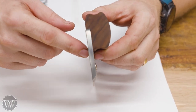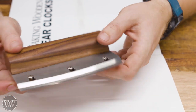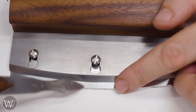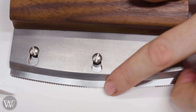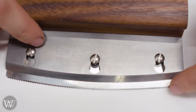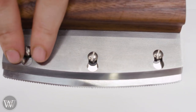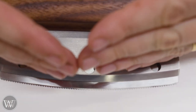One of the interesting things about this is you can release the teeth here and actually pull the blade out, re-sharpen it, and re-saw the blade. They also come with different tooth patterns because throughout the years, in different traditions, there are different tooth patterns you can get. Here we have what is considered a French-style cut — all the teeth are pointing to the middle, cut at 90 degrees, so they're a very aggressive cut. When going in one direction it cuts very deeply; going the other direction, it gives a very shallow and easy cut that doesn't skip around.